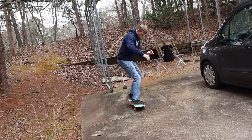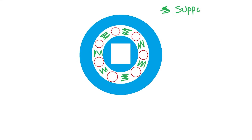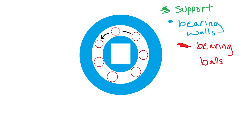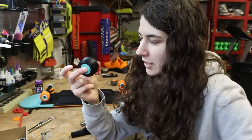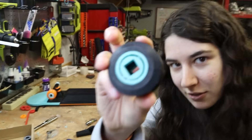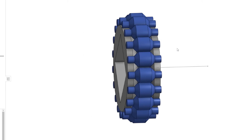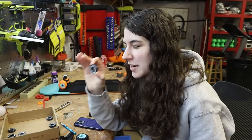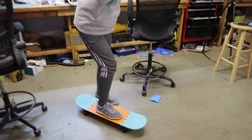Emily here to save you from that trashy explanation. Basically, when we printed the bearing flat, we had supports to break out, and when you remove them it leaves gaps in between the balls, meaning they can run all to one side and throw the entire thing off. The flexibility of the TPU didn't help with this, so we switched back to PLA wheels, and we came up with a new design for the bearings. We went from using spheres in the bearing to using cylindrical rollers, and the tolerance is just right so that when we break them apart, none get bunched down towards one side — there's exactly enough to fill the entire space. This was absolutely the smoothest we were able to get it.